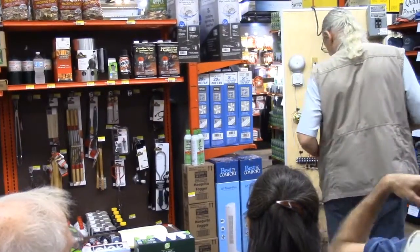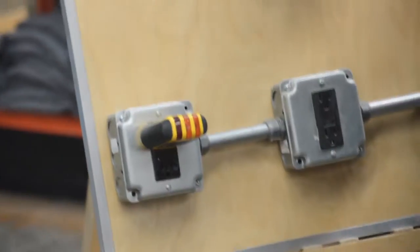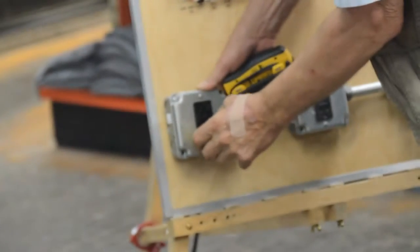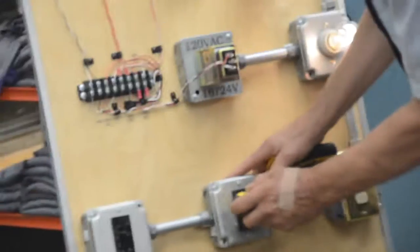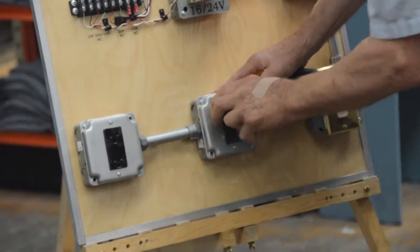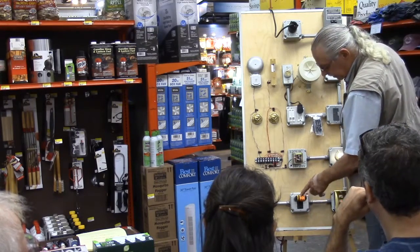Let's say we wanted to track a circuit. We can install this in the circuit. We should be on — hmm, not on. Let's try over here. All right, it's telling you something right off the bat. Number one, it's live. And if you can see the two orange lights — each one of these comes with an instruction sheet, or in some cases it's printed right on the tester. The two orange lights say that circuit's wired properly. It's not backwards.